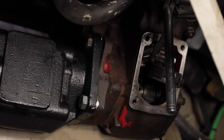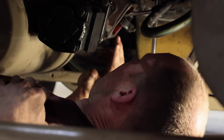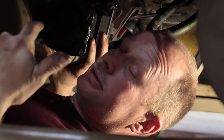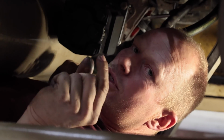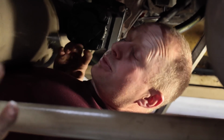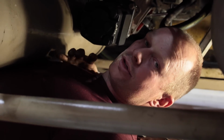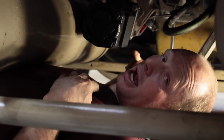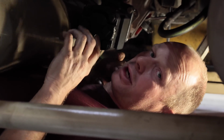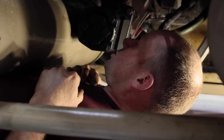Once that's done, we can put our fork back on, which is going to shift this gear and engage the pump when we want it to. Coop's already mounted and ran all the lines for the air line in the cab. So we stole air line from somewhere. You can grab it wherever, from the seat, from your axle lock, just tee into it where it's a pressure side. Then all it does is add air pressure to the fork to engage your PTO, and to turn it off, you take the air away and a spring pushes it back.